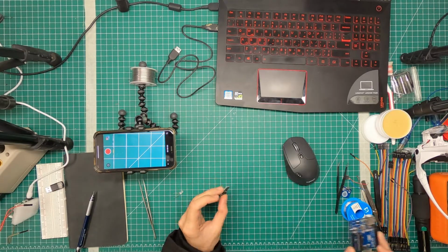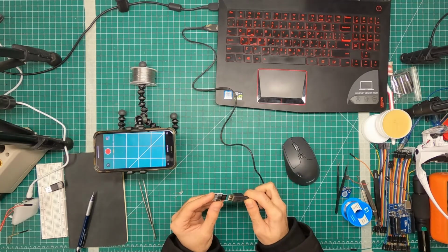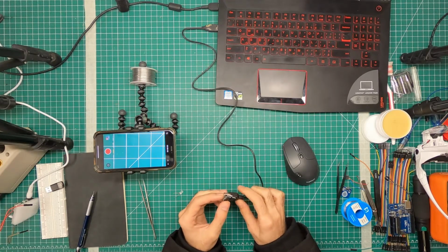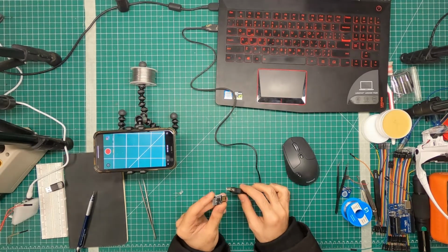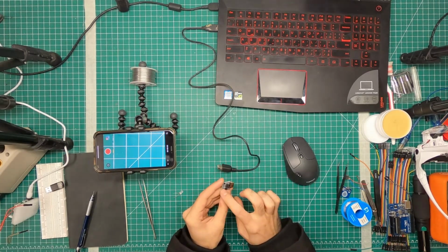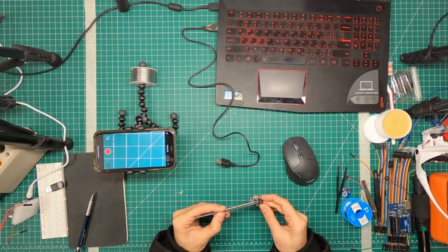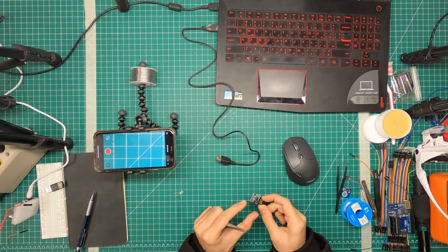The way this works with the USB is that the moment you plug it in, you have about 5 seconds to load the program, and after that the chip goes into whatever's loaded in the pins mode, because 2 of these pins are connected to the USB. So you can't upload a program and run the program at the same time. There's a phase during which the upload happens, and then right after that, the program runs.